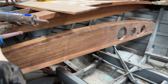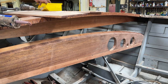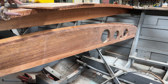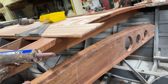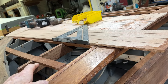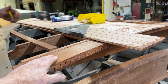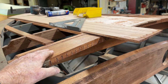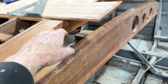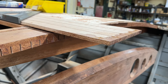While Joe is doing that — I think we mentioned in the last video that this dashboard was completely shot, rotted through and through. The carpenter ants had had their field day on the backside especially. So Rick started from scratch right back here. These two frames were also totally rotted out — Joe fabricated one and Rick fabricated the other. What was really cool is he had to have this convex or crowned plank going across the deck that would secure and be the support both for the dashboard and for the planking above. And I can see the ingenious method he used, putting saw kerfs in it.